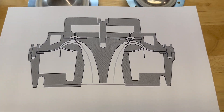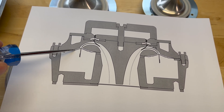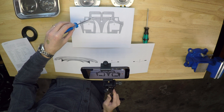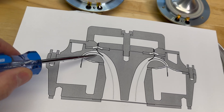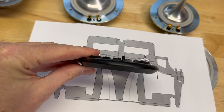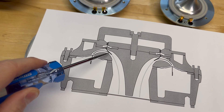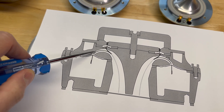So this is the internal construction of the DCX354. This is the mid-diaphragm — all the motor has been taken out so it's not in the way. The energy comes off the opposite side of the coil and goes up and out. Then the high-frequency diaphragm — here's the motor, that's the pole piece. The energy is driven by the coil here, and then the energy goes through this little slot. What this drawing really shows well is the location of the impedance mismatch device. Basically the idea is these slots are open enough for the mid-frequencies to go out, but they're close enough that they look like a wall — or most of a wall — to the high frequencies. So the highs see a high-impedance path here and a low-impedance path here, so they mostly avoid this path. Their tiny wavelengths don't get bounced around in here and come back out, whereas the mids can go right through.